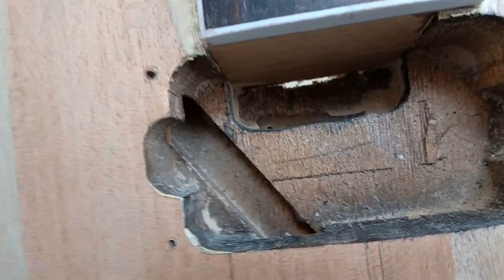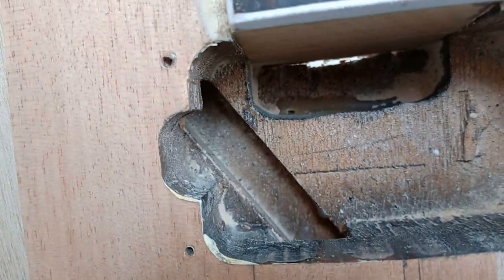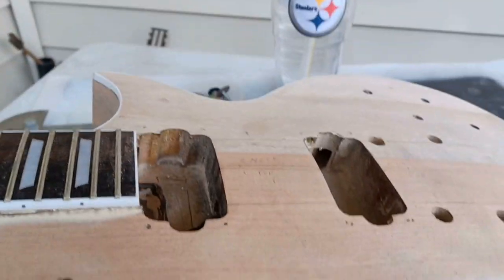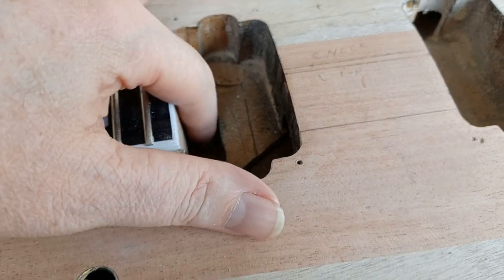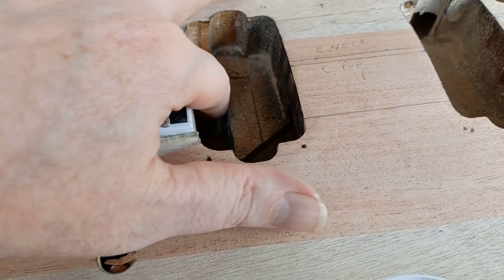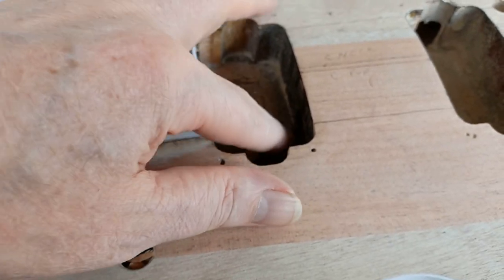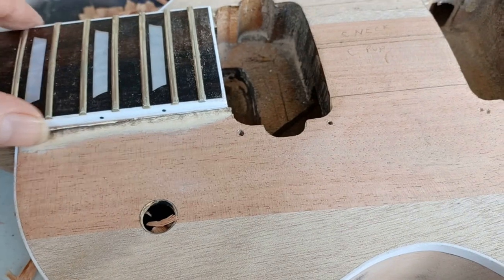As you can see, there it is. So when I make that filler piece to put this all back together again, I'm going to cut that out in there, probably come in a little bit further to give me some more room through the back of this pocket to give me a lip there to really bite to when I fill that back in.